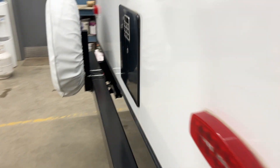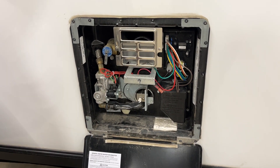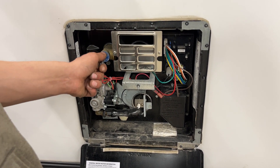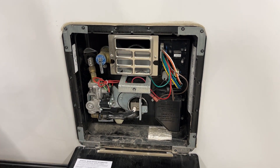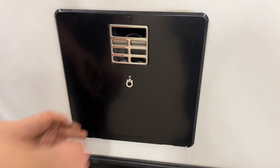In the back of the unit, you've got your hot water tank. Line up this keyway, pop it on and open. All your controls for turning it on are just inside the unit. Before turning it on with either source, hit this relief valve — if the tank is full, you're going to get some water coming out. If you're not getting any water out, there's a chance it's empty, so make sure it's full before firing it up so you're not running the risk of burning out your elements. Lock it back down once you're done.